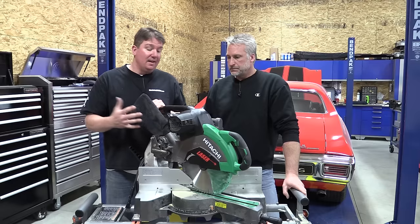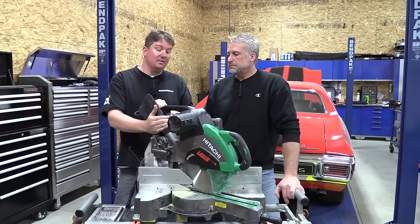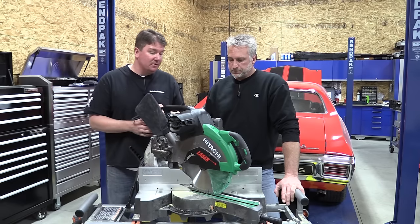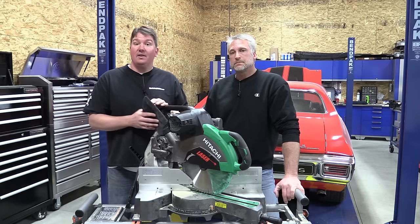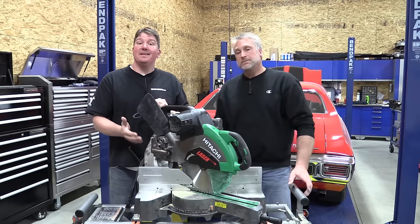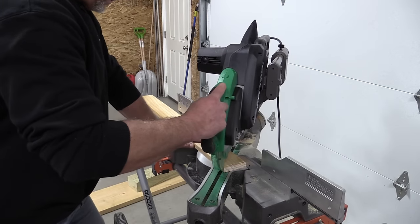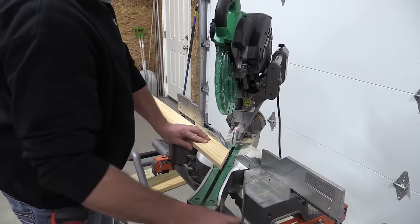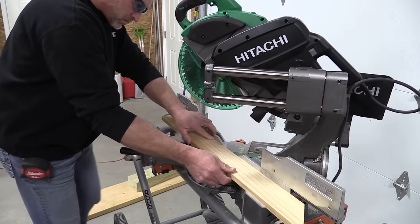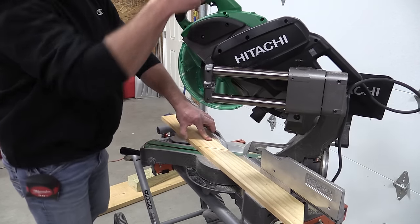Dust collection worked great and it would have been nice to hook up a vacuum or have a universal size for shop dust collection, since it is a zero clearance saw and a little wider. The fences were nice and adjusted well. Overall I like the saw — its downside is probably going to be the bevel, and it also doesn't have bevel detents, which makes it harder when you're trying to adjust from the backside. It's still a nice, powerful, ergonomic, and comfortable saw to use. Stop by Workshop Addict — we have a blog and a forum where we can talk about this tool more. Follow us on social media. Thanks for your time, have a great day.